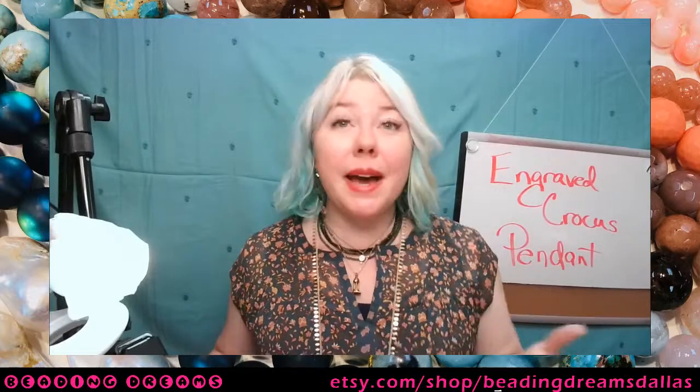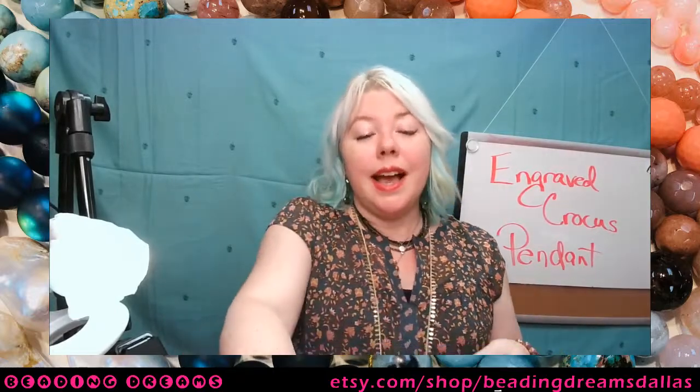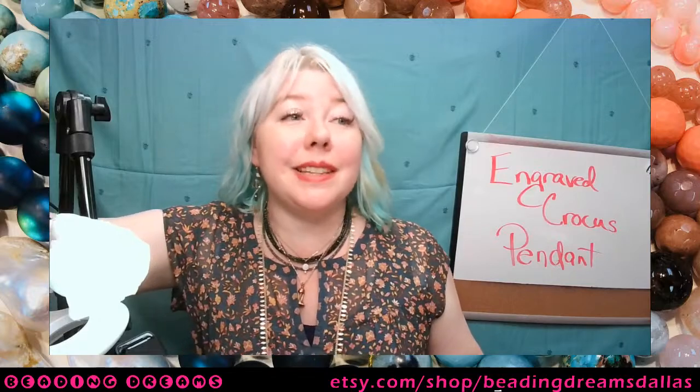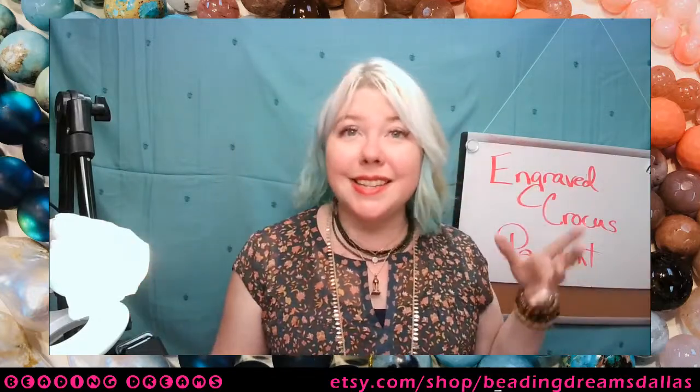As far as how long are you supposed to pickle pieces, the answer that most jewelers will give you is until they are clean. And the fact is that is a highly variable number, depending on a couple of factors. Number one, how hot your pickle is. I've got mine in a crock pot on high, and that's a good temperature for your pickle with your pieces. Number two, how fresh your pickle is, meaning how long ago did you mix it? How many things have you pickled in it since you mixed it?